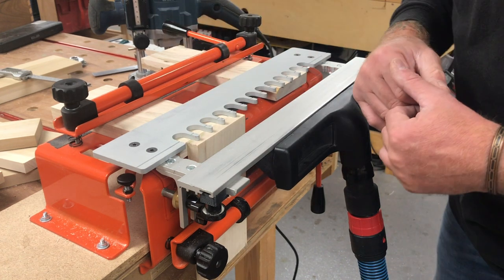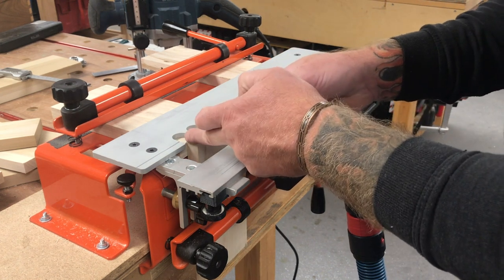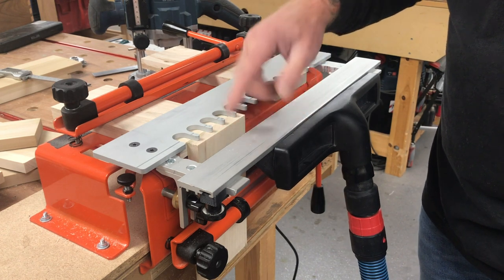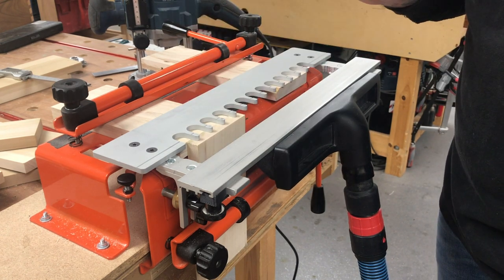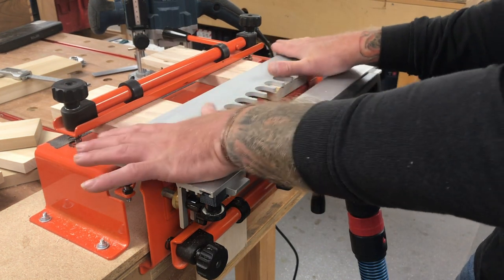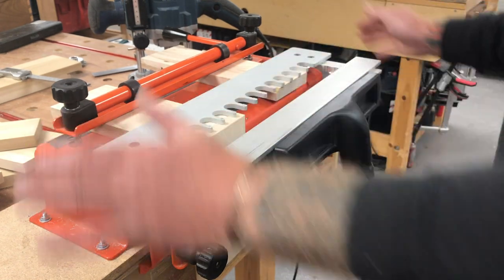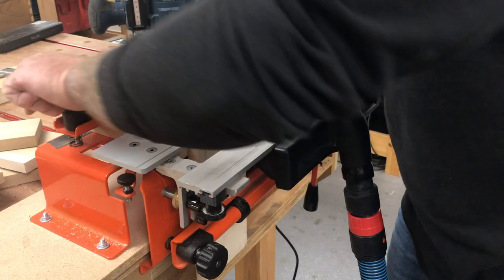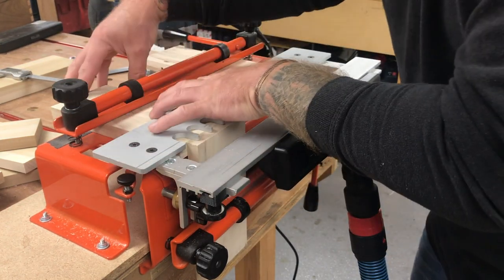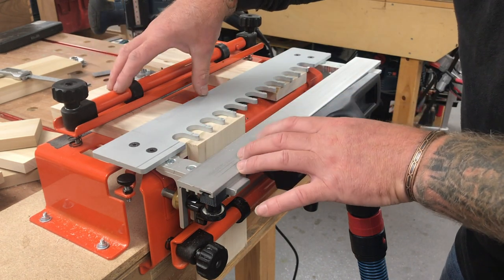Half inch pitch dovetails. These are, we're flat in this area. This board is central to our fingers. We've got our 11 millimeter scribe line, which I'm going to set the cutter to in a moment. Everything locked off. We've got the packing piece here giving us a bit of extra support, so there isn't a temptation for this template just to tip up or down. Everything's locked off positively. You know, we're going into end grain on this board, so if it's not locked and gripped really well, there's a potential for it to twist and skew over.